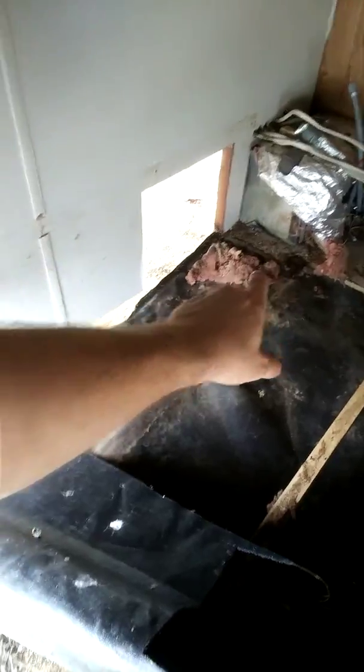Sorry about the mess. I'm going to tie into that, get some new anchor bolts, prime it, and paint this black so that rust doesn't spread to the frame. Right here I'm going to take a 2x4, run it along here and along the walls, and zip some exterior screws down into that 2x4 to hold that wall in. If I pull that waterproof membrane back right here, you can see there was nothing there holding it up. I could take the whole wall and shake it up and down because there's nothing actually holding it — the only thing holding this wall together is this.